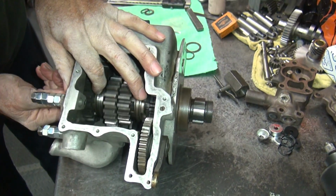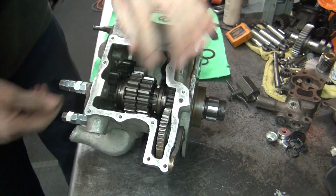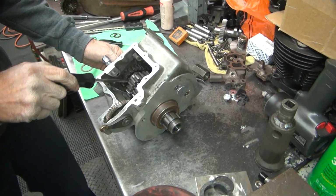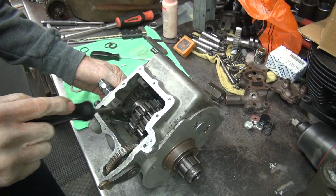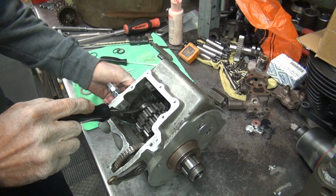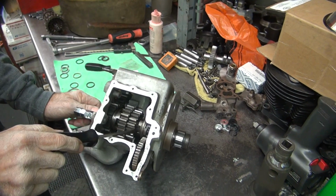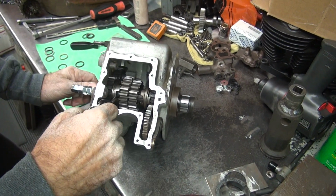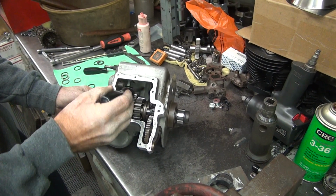And then reverse gear is engaged right now on the other side, but it's fully engaged all the time. I just want to see if that dog is going to go in there. There it goes. Make sure it goes in freely, see? So you have no problem with that. Now that got tight there. We're actually in 2 gears at once right now, high gear and reverse gear. The reason it works is because there's no cluster.